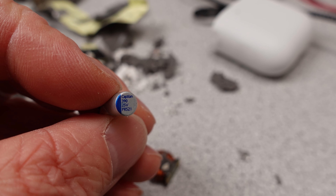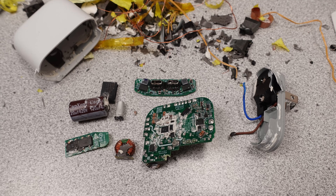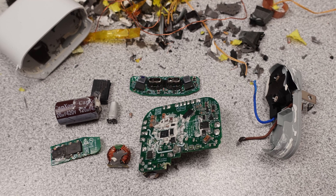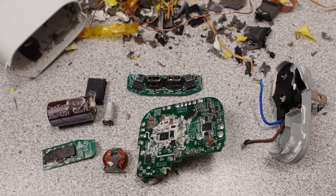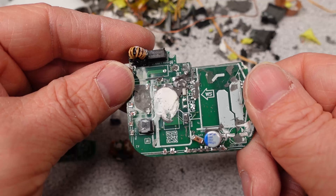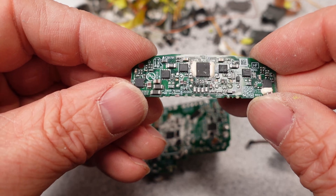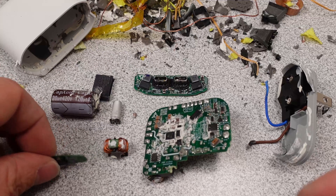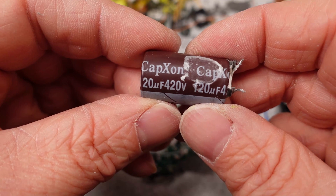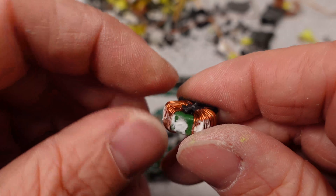In this case, the capacitors are a minimal concern. The adapter does have good quality construction, good components, and the main thing to complain about is the price. It's still expensive, and for that price it looks basically the same as any Apple adapter, which somehow are cheaper than this one. I'm planning a video on watch chargers — probably a short one — but wow, Google and Samsung overcharged for that little puck. Apple, again, being the reasonable price option for accessories? When did that happen? This charger has a few more features in terms of the modes of operation, but it really doesn't do anything special. It's another charger. Very standard form factor, it uses the branded off-the-shelf switching chip, which is all good. It has the requisite components to meet all the requirements of safety listings and the major brand name of Delta Electronics behind it, so it's probably going to last. Thanks for watching. See you in the next one. Goodbye.